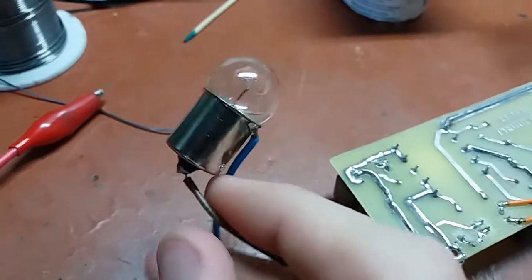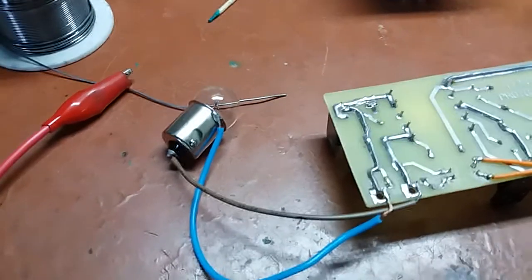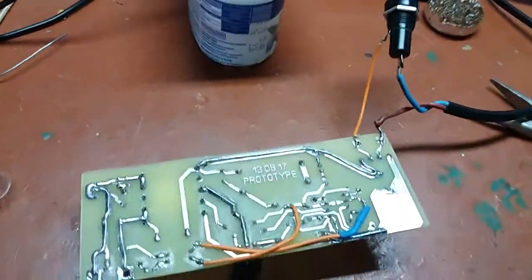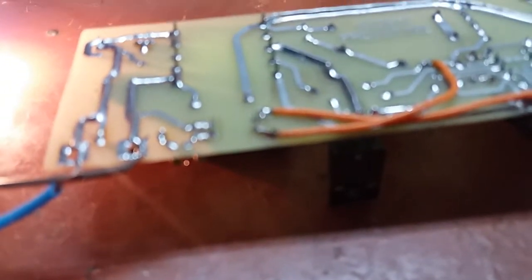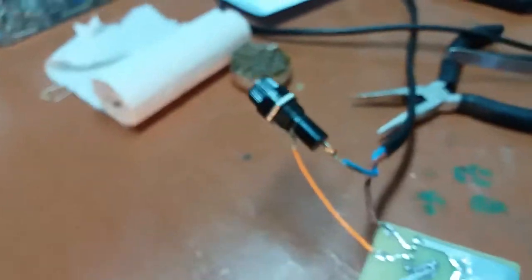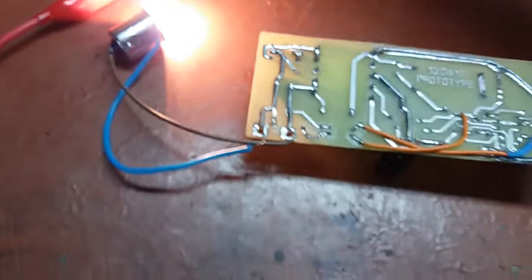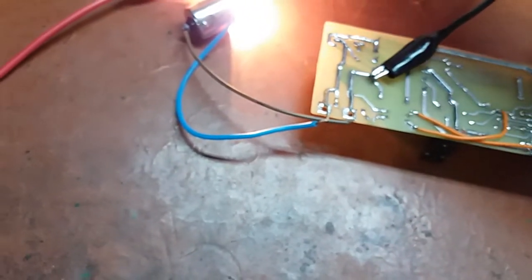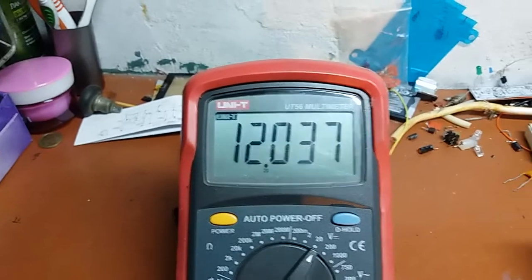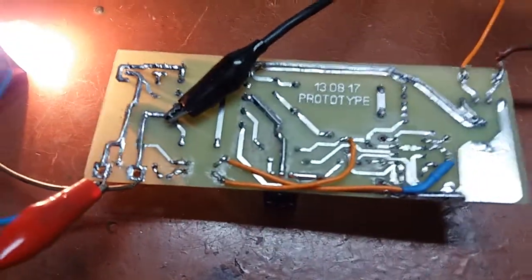When this thing is loaded with this 10W bulb — which actually measures at about 8W at 14V — can you hear that horrendous hiss coming from the transformer? The voltage, by the way, is fine and dandy. You can see 12V pretty close and it doesn't budge. At constant load it is very stable — no fluctuations — but still you have this hiss.